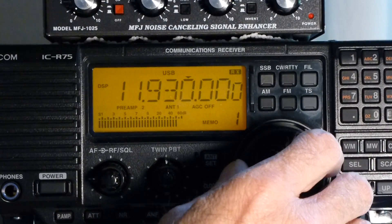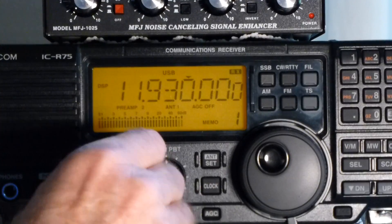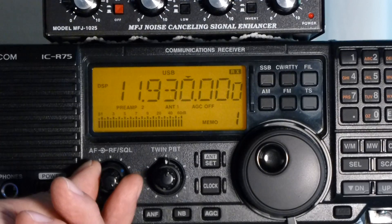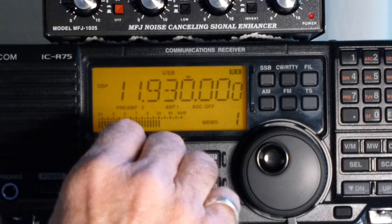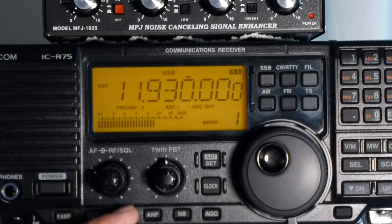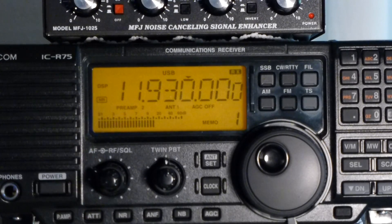As you come up to the station there's the tone. We'll just play with this one for a minute. Turn the volume all the way up, then turn the RF down. The other technique: turn the RF all the way down, turn the volume all the way down, then adjust the RF between 9 and 20, then increase the volume. That's a little nicer — we don't even have the DSP on. That's how it works.